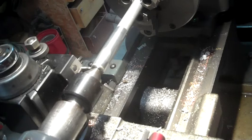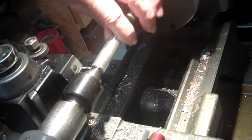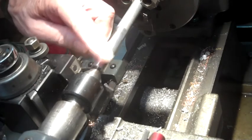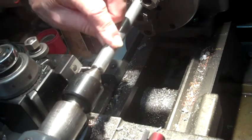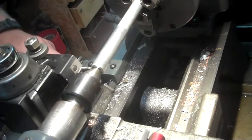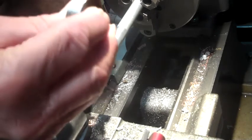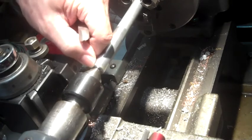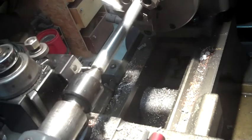What we've done now, we've set up these bearing inserts here. Bored a 1/4-inch hole through the center for the shaft for the bearing to rotate on that'll go in the Lazy Susan. This has been turned to the outside diameter. And now what we're going to do is, the bearings are 3/8 of an inch thick, so I simply line up the cutoff bit here and come down.